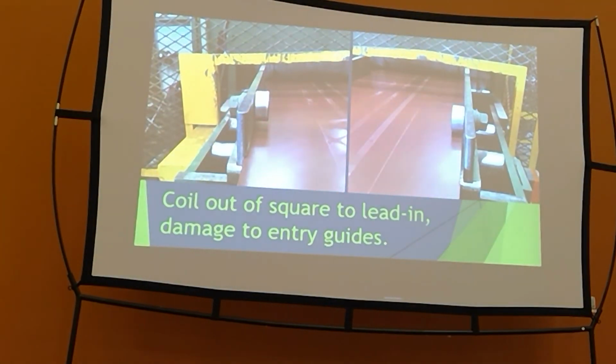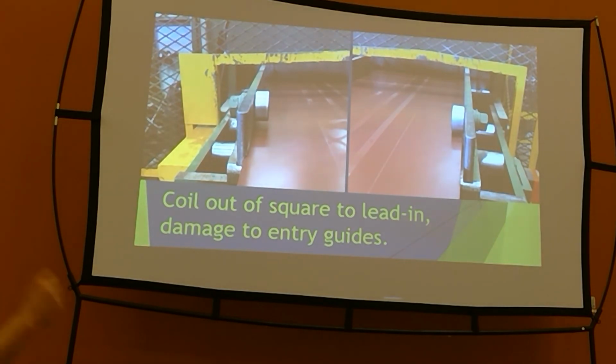This is an extreme example. I actually went to this customer because they were having drive faults. They were faulting out on velocity. They're getting this error on the screen that says drive fault, excessive velocity, which basically means that it was spinning out and losing control. And they wanted to replace the drive. They said it didn't ever happen before, the drive's bad. Well, my people got online, we actually had a remote connection to this machine, and they said, nah, the drive's acting right, it's got good info, it's right.